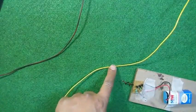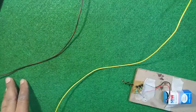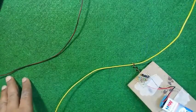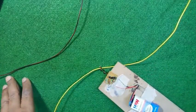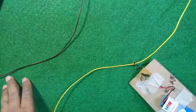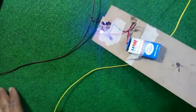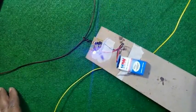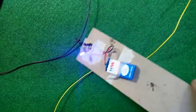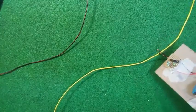For testing, I have connected these wires to the AC supply. Let's check which wire is containing phase and which is containing neutral. When I bring the antenna near the yellow wire, the LED is not blinking. When I put the antenna on the black wire, the LED is blinking — it means the black wire is containing phase and the yellow wire is neutral.